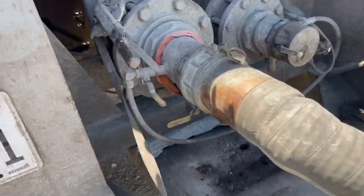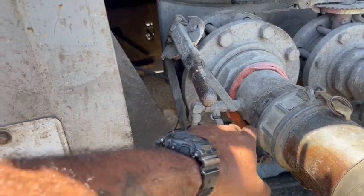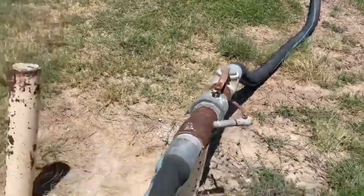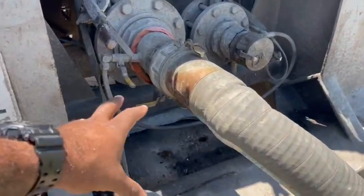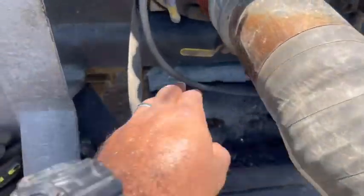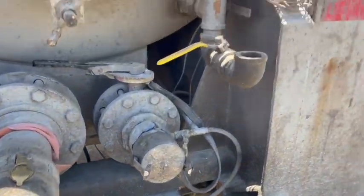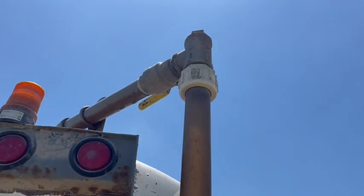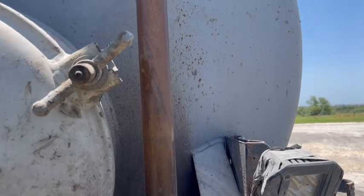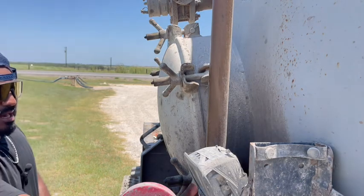We have the valve open here and we're loading up. We want to keep this air valve closed right now — it's not the right time to use that because you're going to blow the line, especially with a check valve right there. That check valve prevents anything from going back. You can open it a little to feel the suction. Now on the sight glass we have a valve on the bottom and a valve on the top. I'm going to show how to clean out this sight glass. To clean it out, we're going to close the bottom valve.